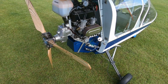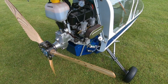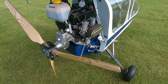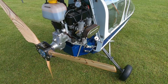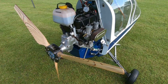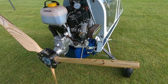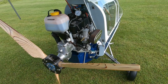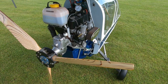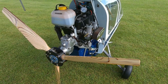Too much maintenance is a bad thing, because you can make mistakes and disturb things. And it really doesn't need a decoke inside 300 hours if you're using modern oils. The rings will need freeing up, but after a decoke they pretty well seize up straight away with carbon, so it's pointless keeping freeing them up. It works perfectly well. I get full power, doesn't change.